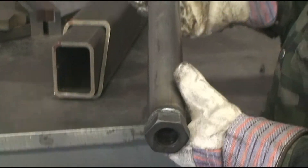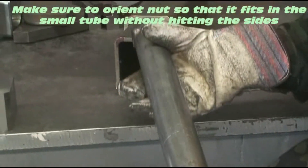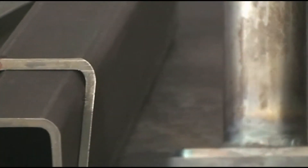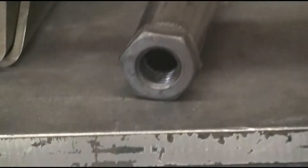The tube that holds the nut in here — now, this nut, the way it is if you follow my design, is it's a little tight in here. As we go, we'll have to move these so that the long edge or the narrow way lines up with the flat here. Does that have to be perfect? Absolutely not — not even close. But just don't have the points lined up with the weld, or you'll have to cut the weld out of the small one too, or grind these points down.